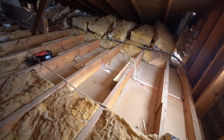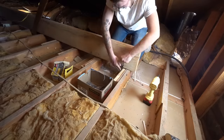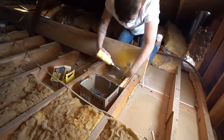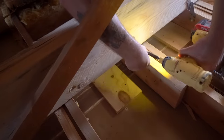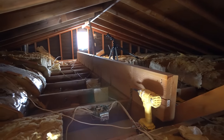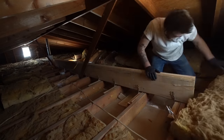I'm not going to lie, this was a struggle to get into the attic, but once I got it into place, I could use what are called hurricane straps to screw this into the ceiling joists on each side. I've also heard these called rafter ties. Either way, I'll leave a link to everything I used down in the description. After I had all of those installed, my strong back or the header beam was complete. On one side of my wall, it extends past the existing header that was there for the doorway, and on the opposite end, you can see here that it lines up with the wall and the truss.